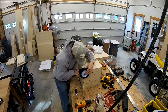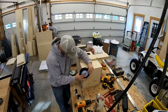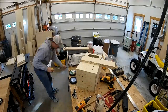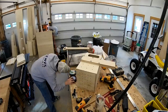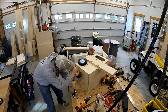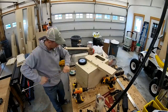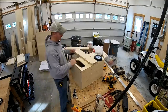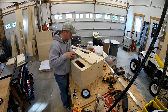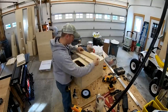Now I've got to figure out where I want to drill these holes for the all-thread rod axle. I kind of just positioned the wheels where I thought they should go and looked at that position in relation to how high my swiveling casters would keep the box up off the floor, and picked the best spot which happened to be right over the plywood bottom. So basically that all-thread will be resting right on the plywood floor.